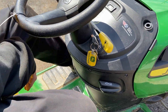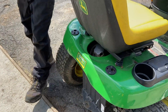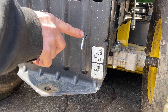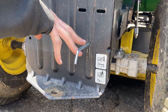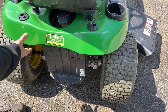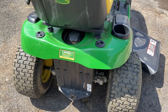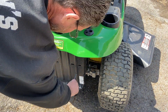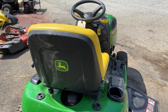Now, let's say you run out of gas or something happens and you have to push the tractor. Go around to the back of your tractor, right above your hitch — there's a little diagram there and a release rod for the valve on the hydro transmission. With the parking brake in the off position, pull this rod all the way out — it'll come out about four inches — and now you can push the tractor easily. When it's in the locked position the hydrostatic is locked in and it doesn't roll easily at all. You should not push the tractor while it's in the engaged position. A lot of people forget to put the rod back in, get on the tractor, go to use the forward and reverse pedals, and it doesn't go — so remember to push it back in.